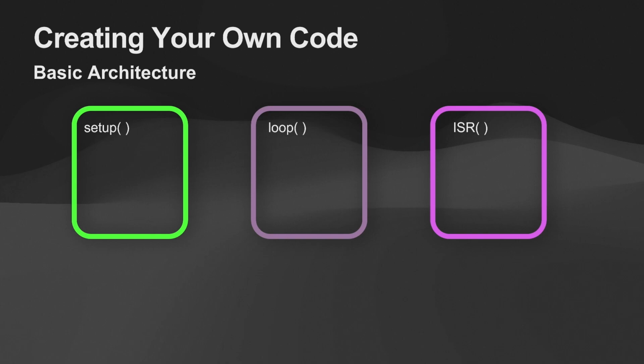And then there's an interrupt service routine that I wrote that does all the hardware stuff. So everything dealing with the lamps, the solenoids, the switches, all that stuff, the sounds, is already all done. And that lives in an ISR. And that ISR works as I used the oscilloscope on the original boards. I made my interrupt service routine work exactly the way theirs did in terms of the timing of signals and stuff like that.